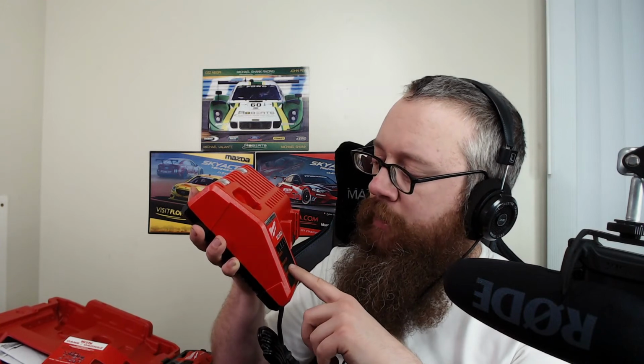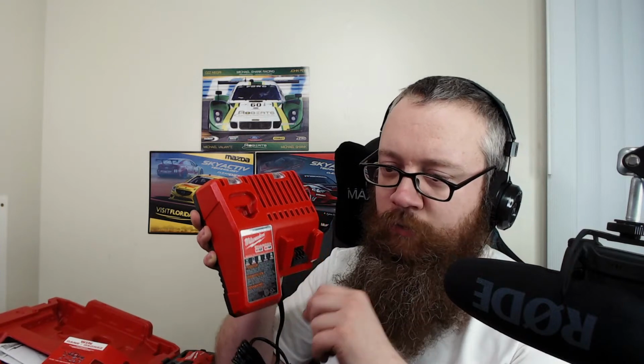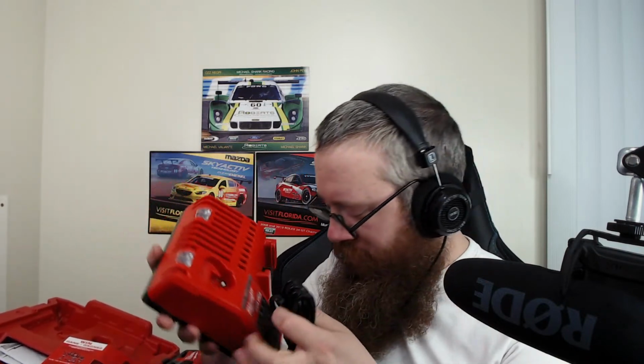If we're in the middle of charging, it does a long blink of a red light. If it's a delay, it does long red flashes, and then when it's charging, it's a solid red. When the battery's charged, it turns green. If it has a temperature issue, it will blink red quickly. If the battery is bad, it will quickly blink back and forth between red and green. So, that's our charger. I get to put this thing to use soon to charge these batteries.